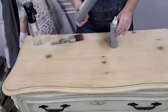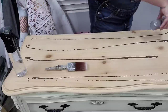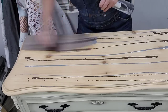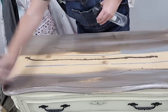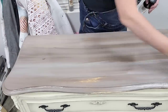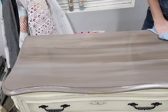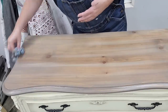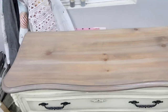With the body complete, it's time to pay attention to the plain pine top. To add interest to it, I'm using two colors of Voodoo gel stain — I started with Up in Smoke and Tobacco Road, but ended up swapping Up in Smoke for Black Magic, so my final colors were Black Magic and Tobacco Road. I streaked on alternating colors of Voodoo gel stain to the top, then brushed them together using a Dixie Belle brush. Voodoo gel stain is a water-based gel stain — it takes to wood really lightly, giving nice soft colors. It's not as opaque as No Pain gel stain, the other gel stain in the Dixie Belle line, so I can still see the grain and pine knots through the stain.